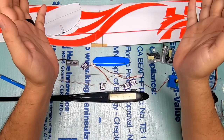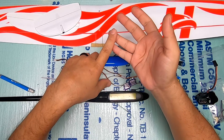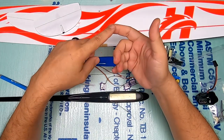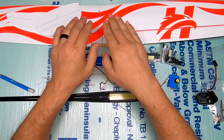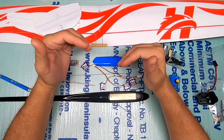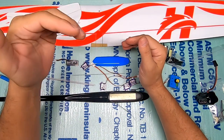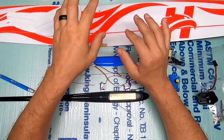For those unfamiliar with DLG advanced programming: you've got rudder, elevator, and two more channels using four servos — the third channel is mixed into the other two. Channel assignments are aileron and auxiliary one. Flight modes include launch mode, where you have a little reflex and up elevator. You need to dial in how much up elevator through a series of test throws, but once set up you can get more height because the throw isn't competing against the wing's lift.